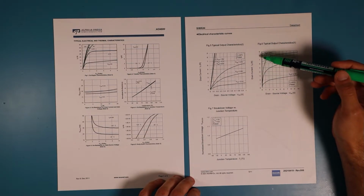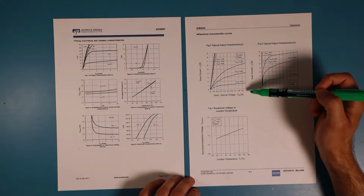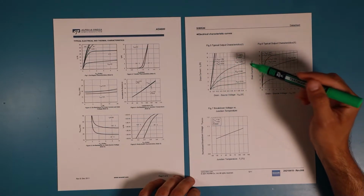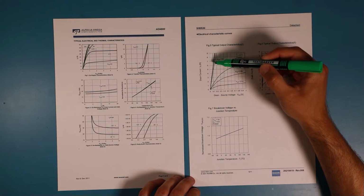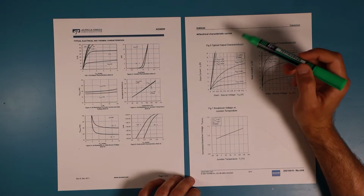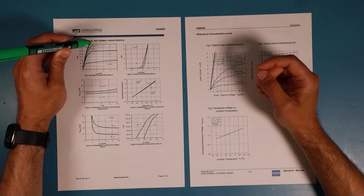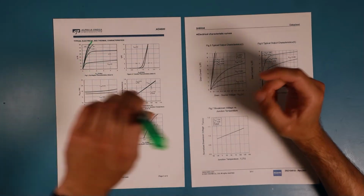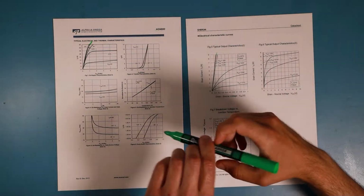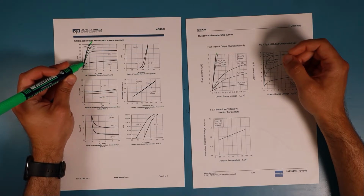We have a little bit too low resolution in this area, so we can go to this chart, which has another scaling on the drain source voltage. There we can see that on 4.5, 5 volts, we have this line here. And on the Alpha Omega, we have this line here. Didn't quite hit it. So when we want to compare it, due to the scaling, it can go a little bit under 10 amps.